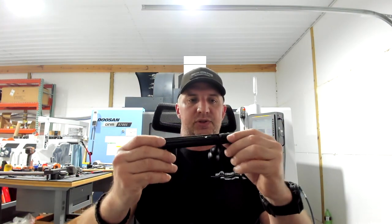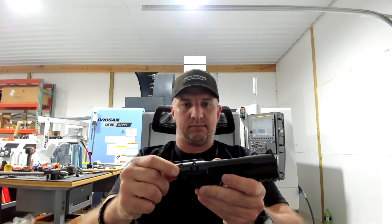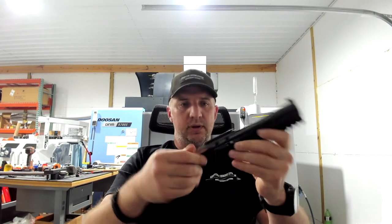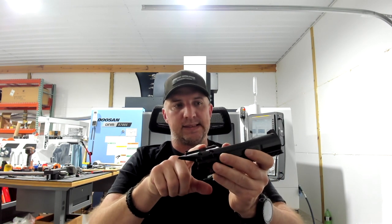So to walk through a couple things here: three-lug, interchangeable bolt head, easy to take down in the field, firing pin removable. It is an integral lug, integral rail action. The bolt stop — Ted's bolt stops are some of the most bombproof bolt stops I've dealt with. I have a history of breaking bolt stops from running the bolt back really hard and fast, but I've been running his Nucleus actions for a couple years with zero issues. And an adjustable trigger hanger — never seen a trigger hanger like this before.